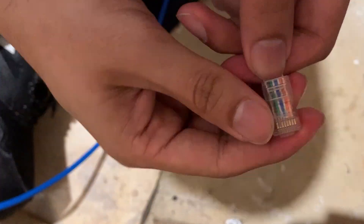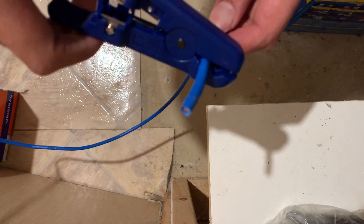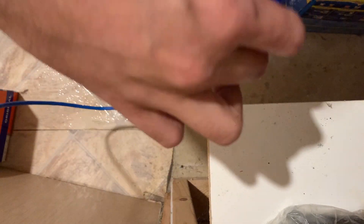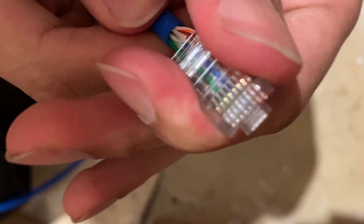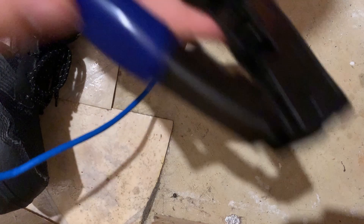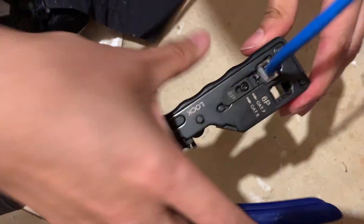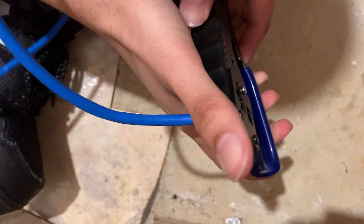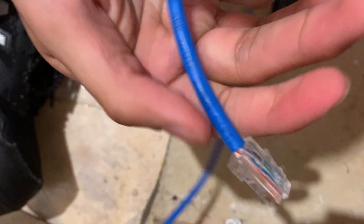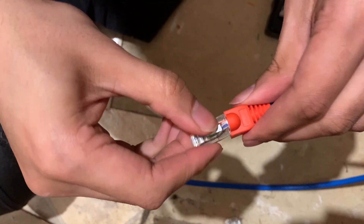As a quick note: when using the wire stripper to cut the exterior of the cable, give yourself enough wire to work with — if your cut is too short it'll make pushing through the connector very difficult. Once everything looks good, push the connector all the way back so it's snug on the cable. Then get the pass-through crimping tool, insert the cable into the RJ45 slot, push it in and press down on the handles to cut off all excess wires. Finally, push the cable boot into place and repeat this process on the opposite end.